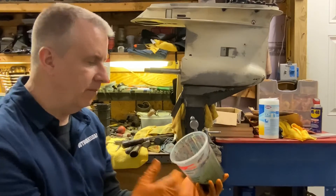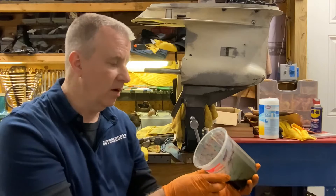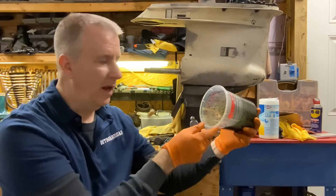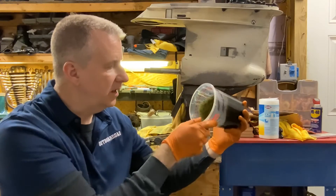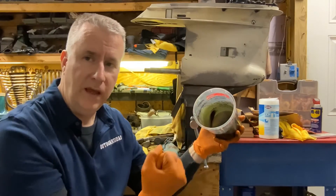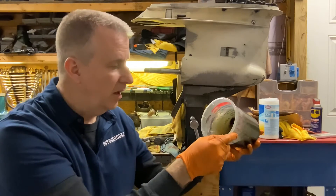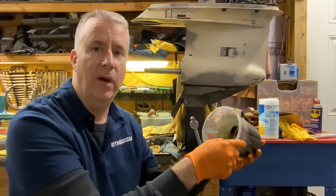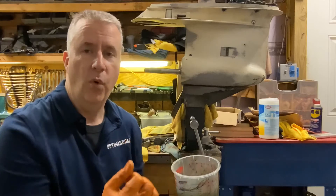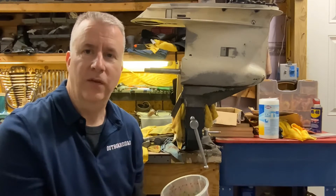Here we have some of the oil. I got about a quart out of this. I dumped most of it out after letting it settle — any debris is going to settle in the bottom. I like these clear containers because I can roll it around and see what attaches to the sides. I don't see any metal filings in here. It looks very clean. The first batch that settled in the bottom had a little frothiness — maybe some air mixed in, maybe a little moisture got in when the oil was last changed. But everything else looks very clean, like this was a well-maintained gearbox. If we see filings, we have to question: did we use the right oil, is there gear wear, am I shifting okay?